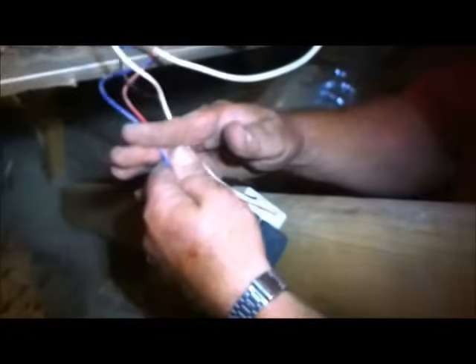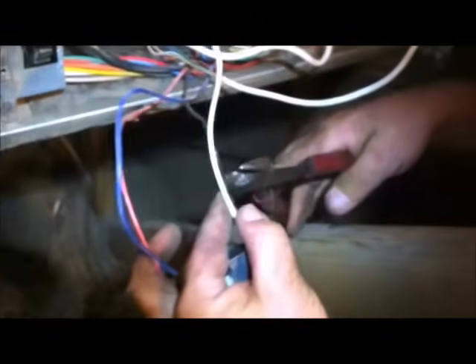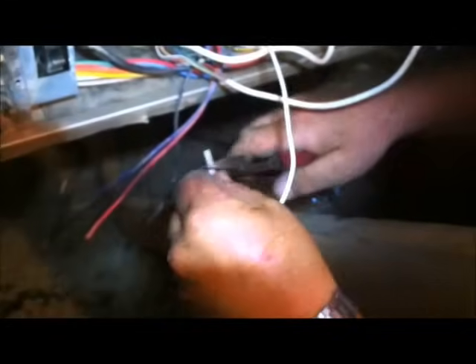All these wires are cut and trimmed, so there's no reason to unplug the old one from the circuit board. We're just going to take our wire cutters and cut those wires. We know these are for 24 volts and these are for 120, so it's going to be very simple to cut and strip those wires and put this all back together. We'll cut those wires, get the old burned-out transformer out of the way, and strip these wires back about a half inch.